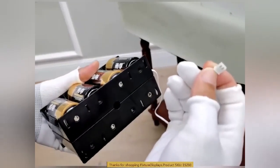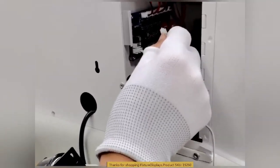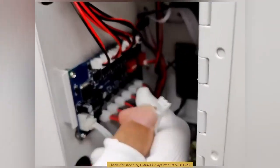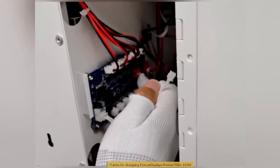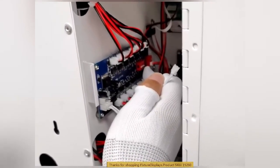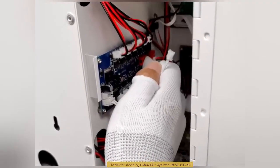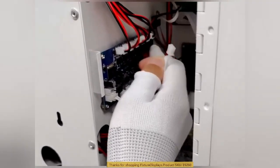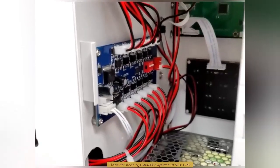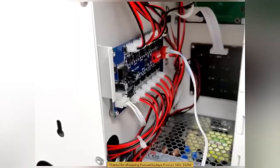Now, once this is powered, we're going to connect this to the locker 15260 motherboard. The connection is to the right hand of the switches on the top position. It's a little hard to see. And those switches need to be flipped up. Again, for a more detailed video, please search 15260 cell phone locker on YouTube. So to use the external power source, you need to purchase this cable along with the 13159 housing and batteries.